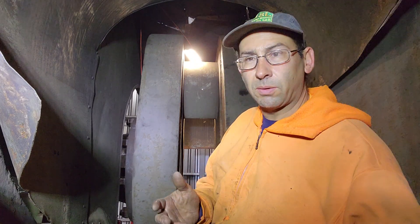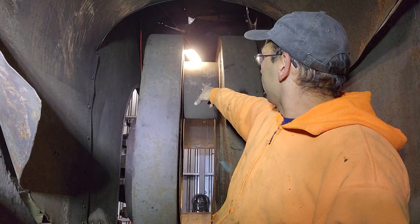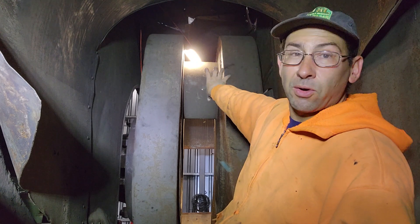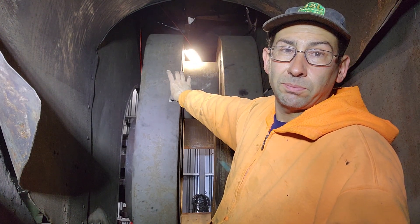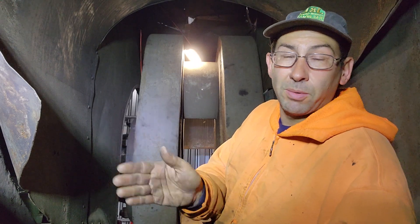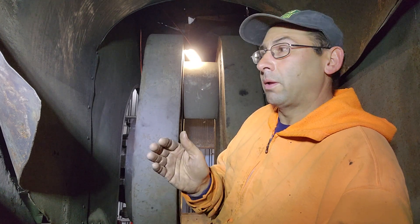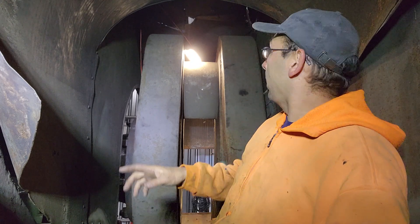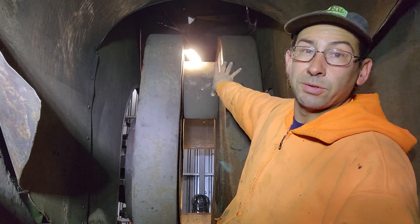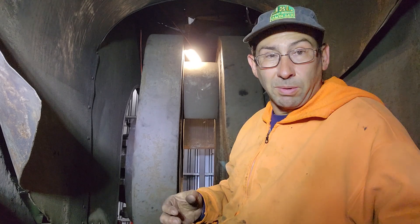One of the things that we're going to be doing, especially on the high pressure side right now, is to get a large micrometer and measure that crank pin. The drawing says it should be 22 inches in diameter, so I just purchased on eBay a 21 to 22 inch micrometer. I also picked up a 21 inch standard so that I can calibrate the micrometer to it. And when we're ready, we'll go and remove all the cosmoline off of that, polish it up, and then do a series of measurements, which we'll use to make something called a mandrel.